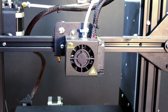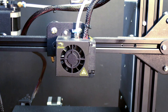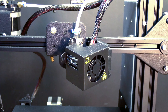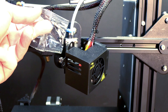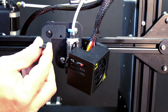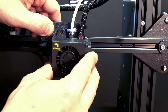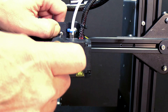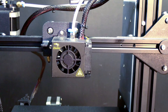Don't be scared, but we are going to take this cover off. You are going to remove this screw and this screw. You can see how easily the Ender 3 Pro cover just moved aside. Have a look at the screws that came with your CR Touch — we are going to take these two longer ones and use those. The reason we are using the longer ones is because we need to pass them through the cover and the bracket. You will see how it fits nicely with a gap to leave space for that screw head. We're going to hold it in place, then place the cover back. The longer screw passes through the cover and the mount for the BL Touch or CR Touch. And that's it — you've installed your probe mount just like that.